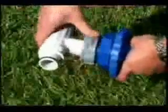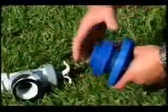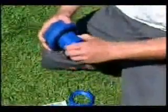Begin the assembling procedure by removing the plunger valves from the threaded connectors. Set the plunger valves and step washers aside for the moment. Unscrew the nut from the threaded connector with the strainer basket attached, leaving the flat washer on the connector. Lubricate the threads on the connector with petroleum jelly. From inside the pool liner, insert the connector into the lower pre-cut hole. Note that the flat washer goes between the connector and the inside wall.